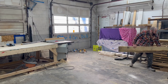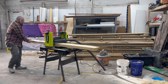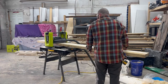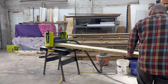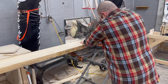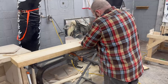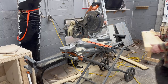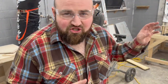First I grabbed a two-by-eight length of poplar that I had sitting in the shop from another order and started milling it down, trying to get it close to flat. I don't need anything perfect for this project so I didn't have to joint it or anything — I just got all the roughness off. Then I took it over to the chop saw and cut it into smaller, more manageable pieces. This big long 10-foot length is pretty heavy and I don't need it that long — I'm going to cut it up into a bunch of little cubes.